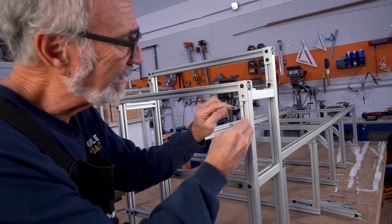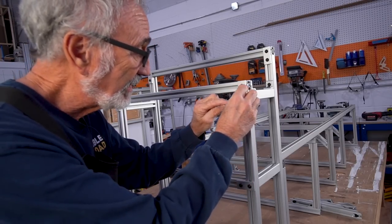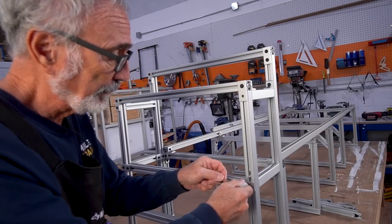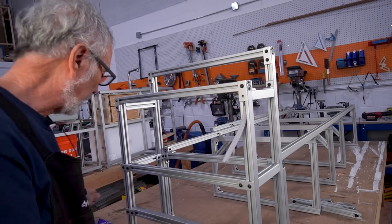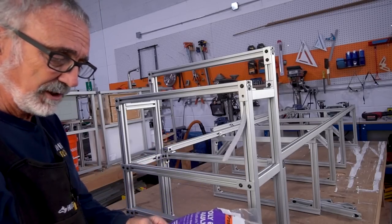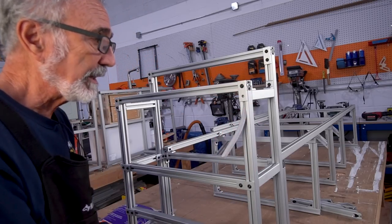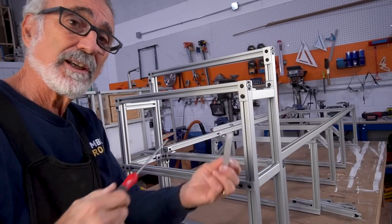I'm trying to get this T-nut up in position so I can get the screw in, but it falls and drops. A viewer — one of our good Humble Road community people — sent a suggestion in a comment: slide the T-nut where you need it, then put a piece of rope caulk. It comes in different thicknesses — 5/8 is for your 15 series — and now look at this: you put that caulk in place, slide the T-nut, and it holds it until you get your screw in, then you take it right out.